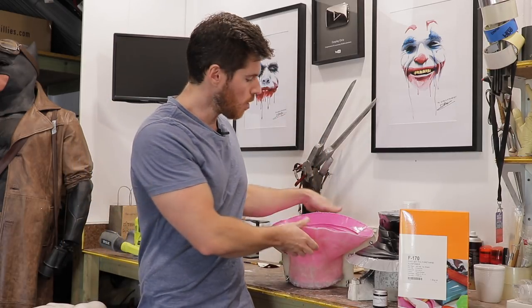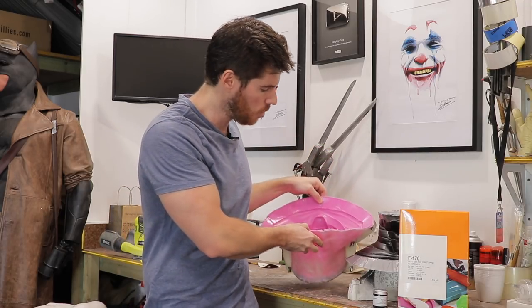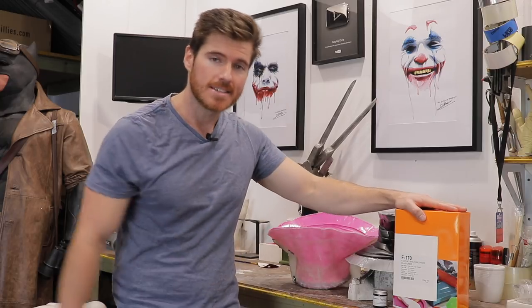This is a relatively easy mold — not a lot of undercuts. Something like a Batman cowl or helmet can be trickier, especially in the chin area. Our first step is to glove up. I'm also going to use a respirator because F170 and the F-series can get a bit fuming — you don't want to be inhaling that. Working time is five minutes and demold is two to three hours. I've used slow set urethanes before for slush coats and it's a pain — each coat takes about 40 minutes before it starts to gel. Now let's get our scales, mixing cup, and mixing stick and get to it.